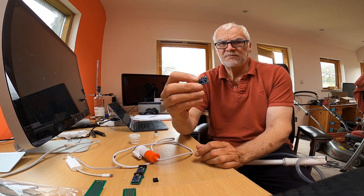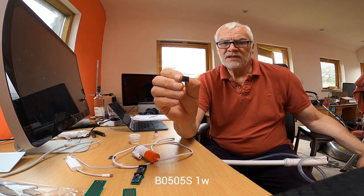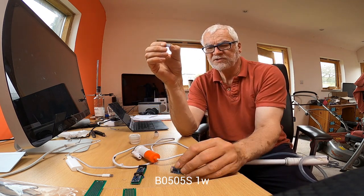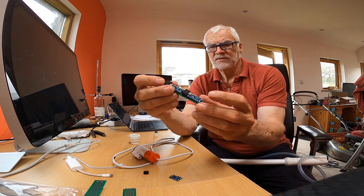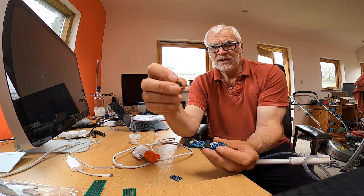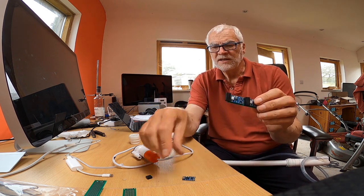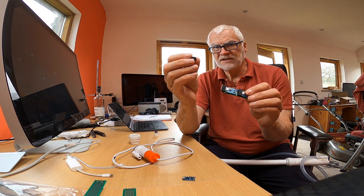Mostly the batteries barely get discharged when you empty a boat. You need three of these charging chips because we have three batteries in series, but we need to charge each battery separately. I put this whole arrangement on a little PCB that fits inside the pipe. The B0505S isolator chip isolates the three separate circuits so that when you plug your USB in, each battery is charged independently. You'll get a different light on each — orange when charging, blue when charged. Without these isolators it would just short circuit because all the grounds connect.